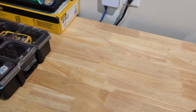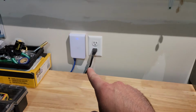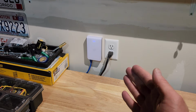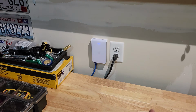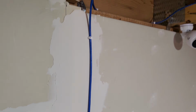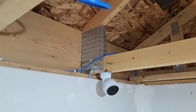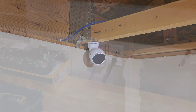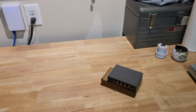And I wanna say, if you're ever fortunate enough to be in the position to plan out where these are going to go, you know, you're doing a new build like this was, or a remodel, just double what you think you need. Over plan up front, over provision. This is the second time, in fact, I've needed to use one of these in a very similar setup. And so, yeah, if I had sent 2 or 3 drops to each outlet, or at least a few of them, like the garage here, I wouldn't need to be messing around with this stuff.